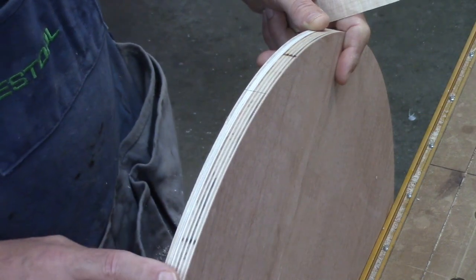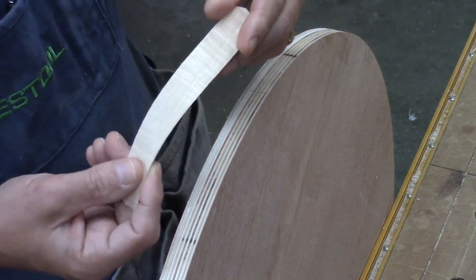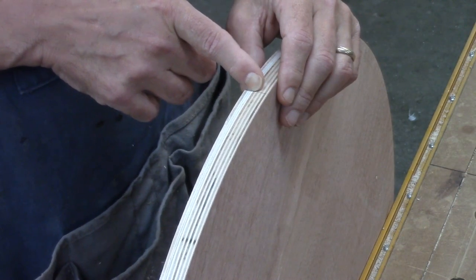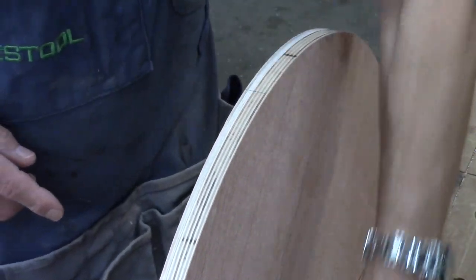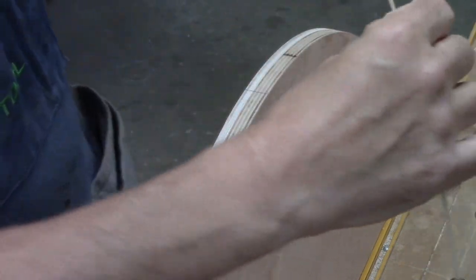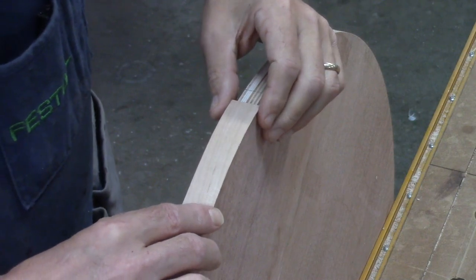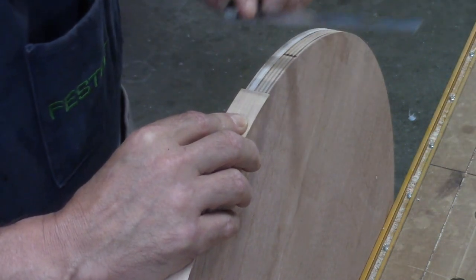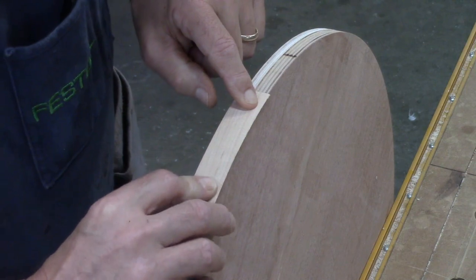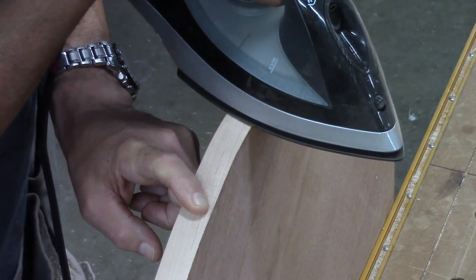With the top sized to its final dimension of 24 inches, I'm getting ready to add the edge banding. I'm using an iron-on edge banding — this is curly maple. There's going to be a seam no matter what, so I struck a line that's perfectly perpendicular and cut an edge that's perfectly perpendicular to give myself the best chance of success. I line it up carefully — it's really fragile — and then take an iron to tack it in place to start it.